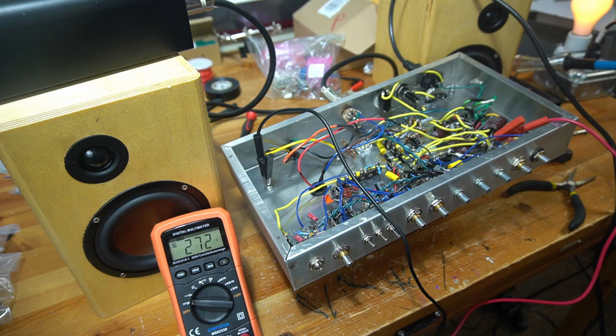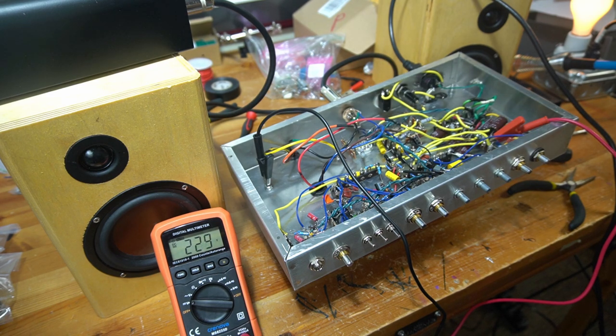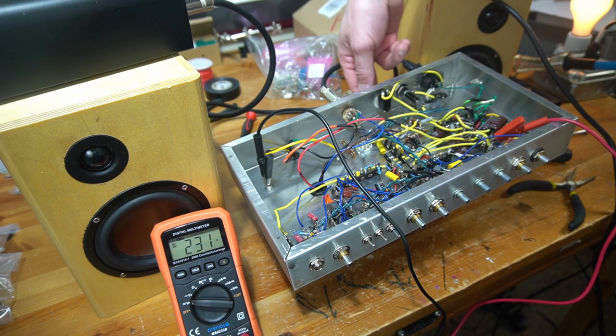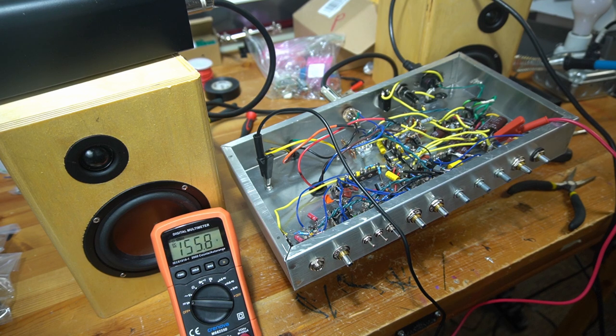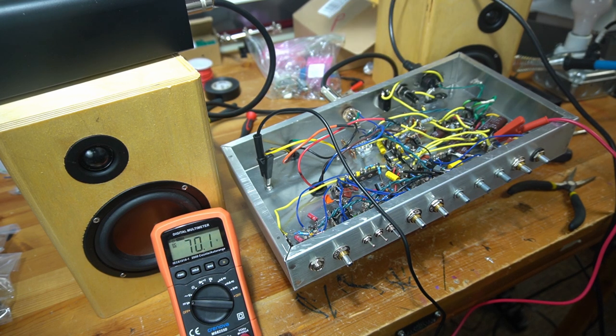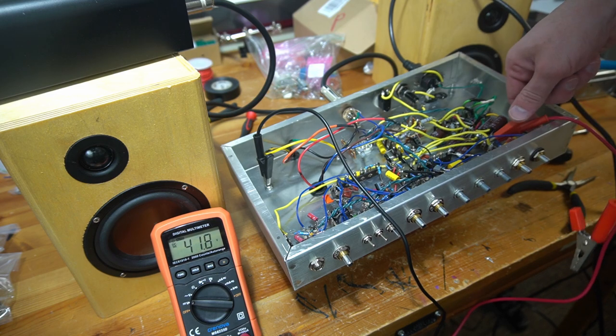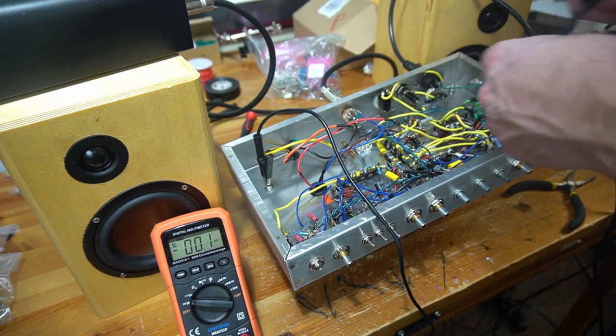Okay, can you hear that? I think that's my load box screaming due to positive feedback. But I think that's a good sign. So I think that means I need to switch my output transformer wires. I'm sorry, I also realize I've got the laundry going, so I'm sorry about that. But that's just the truth of the situation.